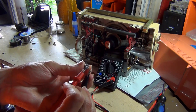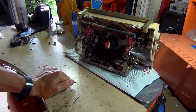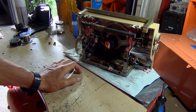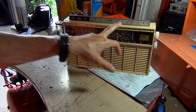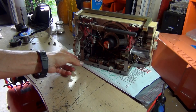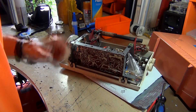On one side there's a bit of an issue with the transistor — the other one was okay but I replaced it anyway. After powering on, I'm still getting nothing. I tested the OC169s and they both check out. The next thing to look at is the voltages. I found the HMV Range Master schematic which appears to be pretty much identical to this board, so I'll be testing the voltages in part two.